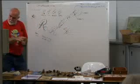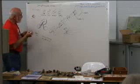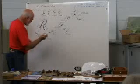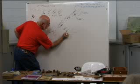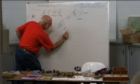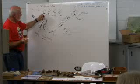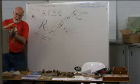I wanted to do those grace line cuts for you before I explain this, because this will make more sense to you now. With this part of the tool, if I use another coloured ink just to make this a little more apparent, the heel, this part, and the cutting face here, we cut that away, just grind it away into a soft curve, so that it will go in and then come out again. And the same thing with the onglet. Any of these tools, when you look at them, have an ever so slight, what we call set.